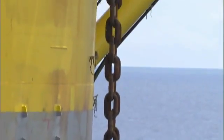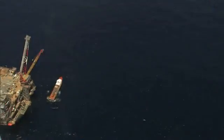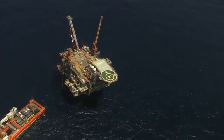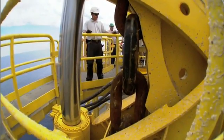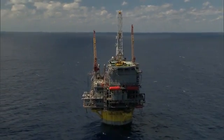The mooring system is versatile in terms of moving the spar hull around a number of locations. The wells are on the seafloor and are drilled directly from the spar hull, so you want to get the spar directly over that well to drill it. The mooring system serves that purpose as well — to move the spar hull over the wells. It's been a very challenging design, particularly given the deep water at Perdido. This is the deepest spar production facility that will ever have been installed.